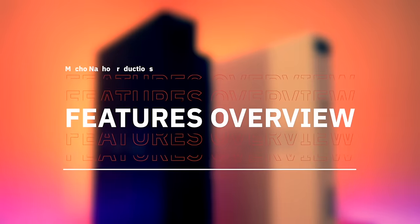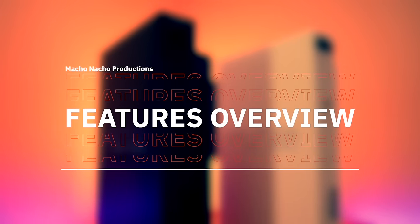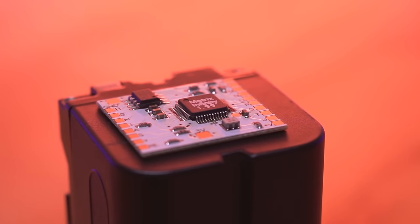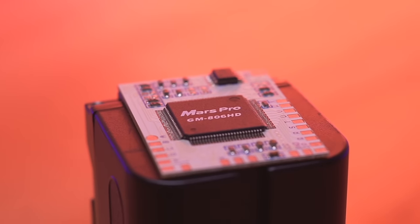The fundamentals of the mod are exactly the same, but the BIOS chip along with some other components are arranged differently on the board, making the wire routing just a bit different. Now that we have the mod working, it is not fully functional — which brings me to one of the first issues with mod chips, especially if you buy them nowadays. A lot of these mods are clones of older chips, so documentation is hard to come by and is often buried deep within forums. Modsville USA was able to dig up some information on the Mars Pro chip and found that it is supposed to be compatible with nearly all model PS2s.